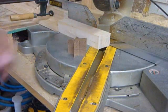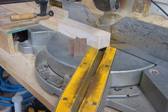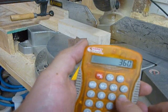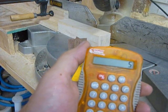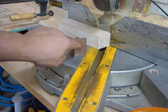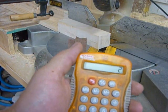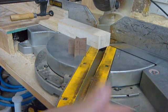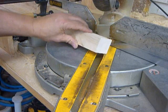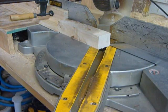In order to figure out what we need to cut the maple at, we need to do a little math first. We know that a circle is 360 degrees. If we divide that by five — the number of points in our star — we come out with 72 degrees. That's the angle we need. However, we're cutting two halves, so we divide that by two and come out with 36 degrees. If we cut this block at 36 degrees, flip it over, and cut it again, we'll be left with our 72-degree cut, which should fit perfectly into our star.